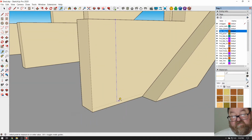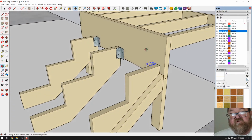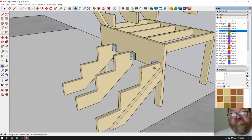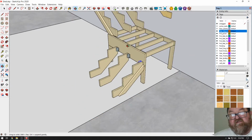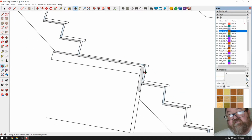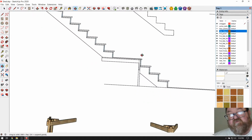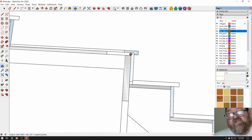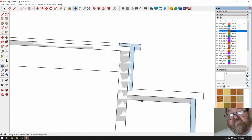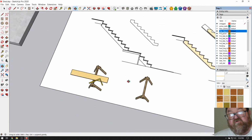You're going to find this in real life that it's not going to, that's 6 3/16. That's correct. So you're going to find this in real life that you're going to be a 16th off here, a 16th off there. What you don't want to be is 3/8 of an inch off here and there, okay? And the only way you can keep from being off that much is playing this out like this, okay? I've done this, helping Ray and Danner with this, but for your own personal projects, there's no way you can figure it in your head, I guess you could if you thought about it long enough, or draw it on a 2x4, but seriously, you need to lay these out on paper and get it on a scale drawing, okay?